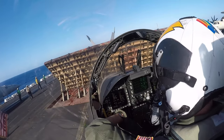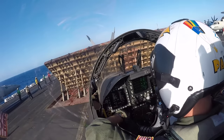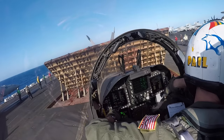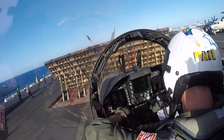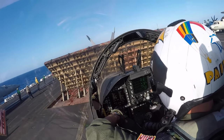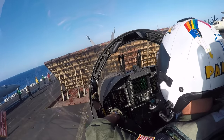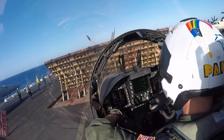You saw me take a quick glance to my left and back to my right, and with my right hand I moved the wing fold switch into the spread position, so our wings are slowly spreading. They're spread by now. We're good to go. The JBD is designed to cool down the exhaust from a Super Hornet, which in max grunt right before a catapult launch can get as hot as about 2300 degrees Fahrenheit. So it certainly needs seawater to cool that thing down, otherwise it's going to be melting tires and shoes if somebody were to taxi or walk across it after a cat shot.